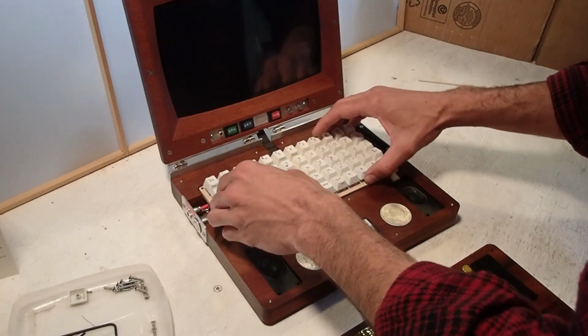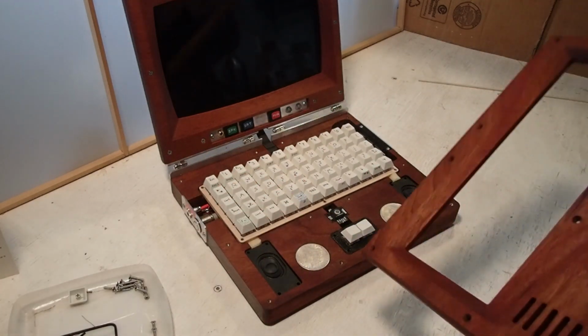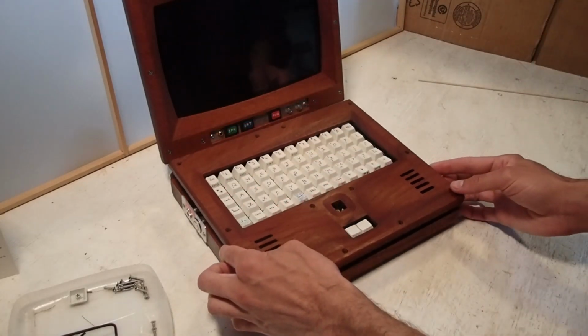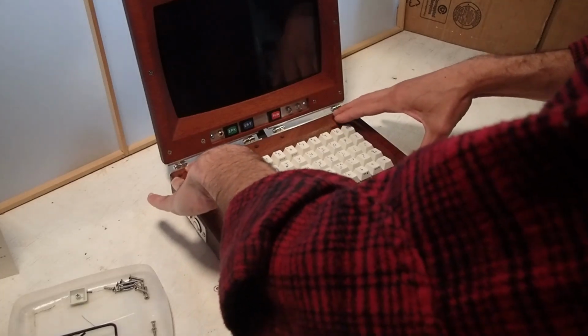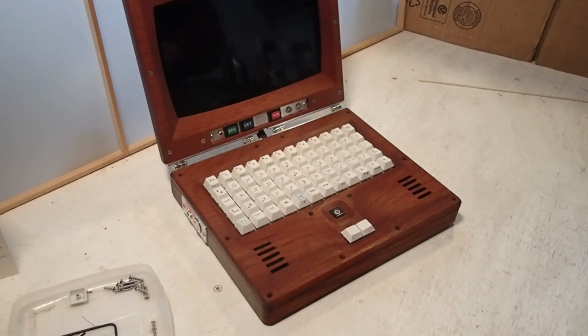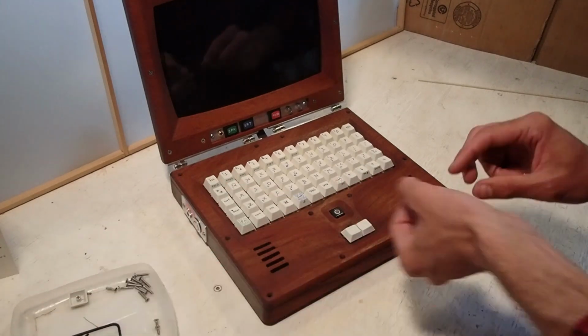The ribbon cable in the hinge is a 10-conductor silicone ribbon cable. I think it's like 28 gauge. And originally I thought that the power was going to be a problem, but it doesn't really warm up. The hinge cable has the power lines, the speaker lines, and the USB cable all running through it. And so far they haven't interfered with each other much.